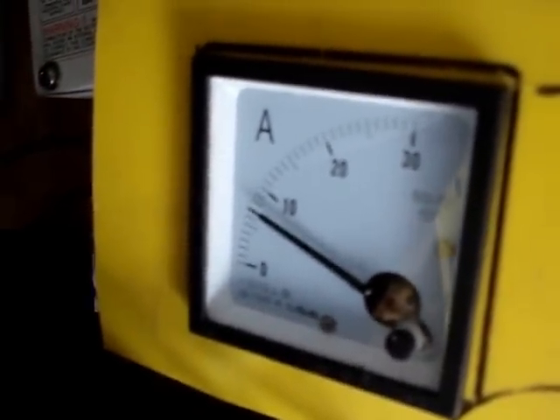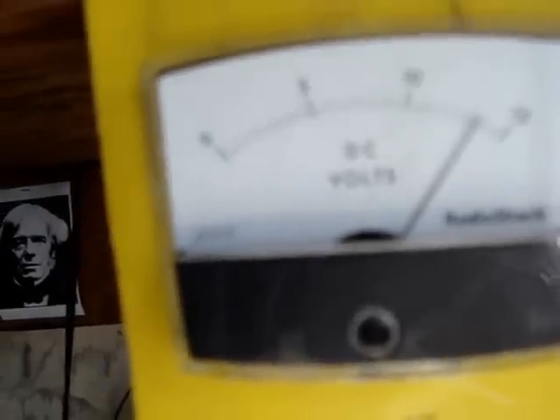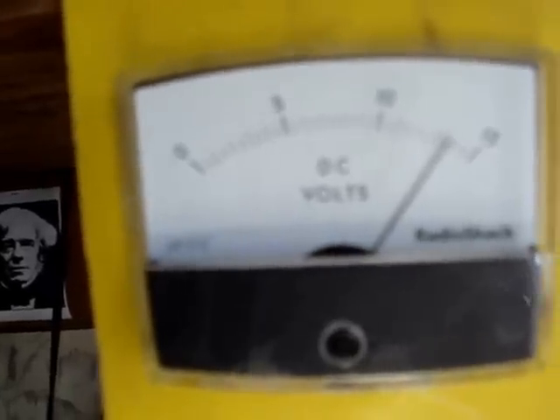It actually shunts the power — it actually regulates the amount of flow of the current. So now I turn that off so there's no amps flowing from there. It's a pulse width modulation, showing a decrease in the amount of power going through, because my battery voltage is set for float at 13.5 volts. And it cuts in at 13 volts.